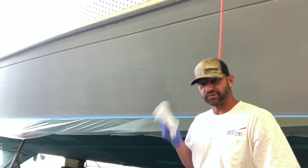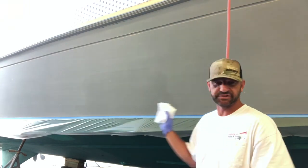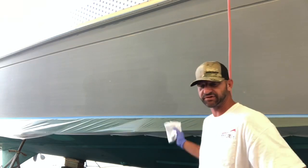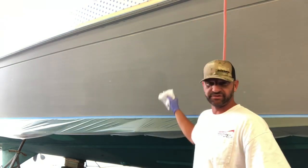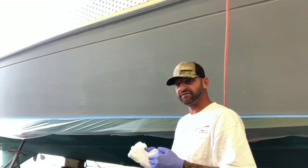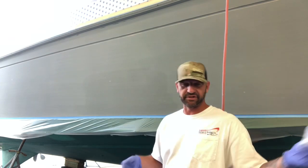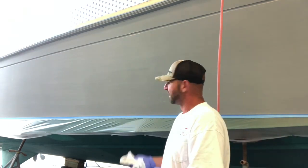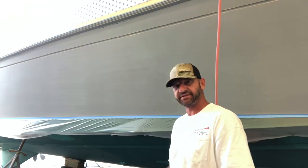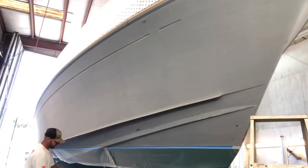You do not want to solvent wipe a boat this size with one rag, and if you keep using the same side, you're just going to start smearing everything you're trying to clean off into your prep surface. So be sure to continually unfold and refold your rag, and like I said, when you hit every section of the rag, chuck it, get another one. I'm going to do this in time-lapse status, and I'll get back with y'all when it's tack rag time. See you soon.